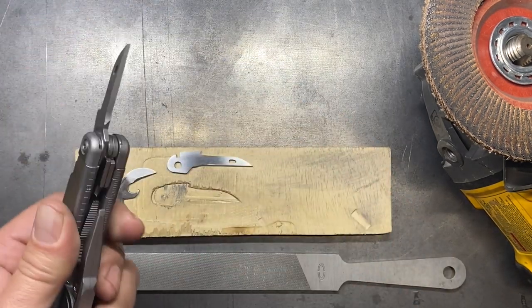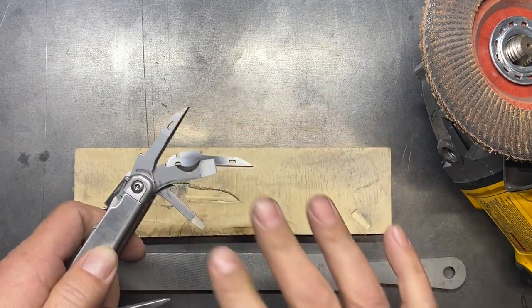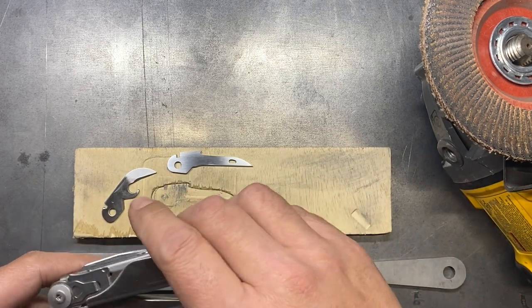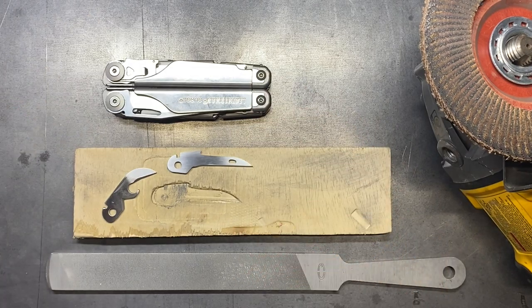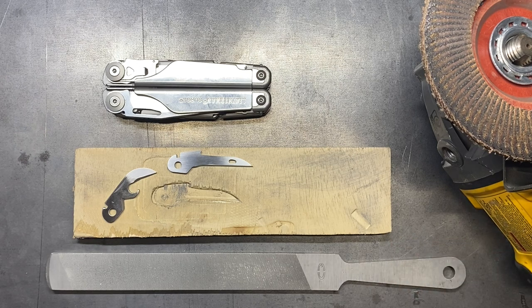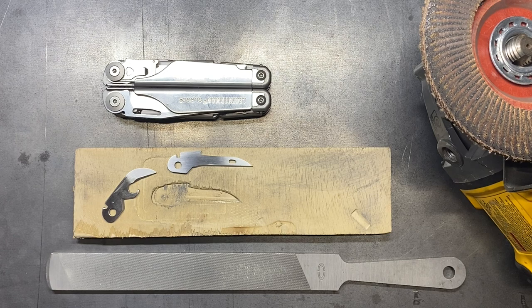The reason I have to do that is because to get the fourth tool in here, I have to take material out of all three implements in order to accommodate it — plus those spacer washers that we're going to be using so that we get just a good fit-up. I'm going to take this tool apart now because I need to measure each one of the individual implements and notate them as well as the spacer washers, so that when we go back in and start reprofiling all these tools, we get the right amount of spacers and the total width correct, including the spacer washers in every implement.